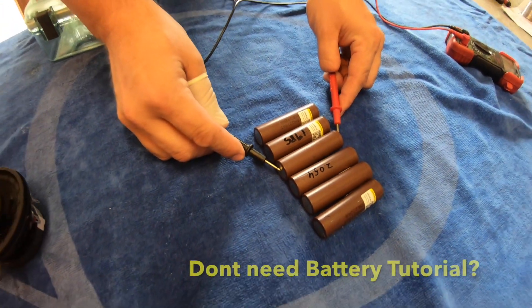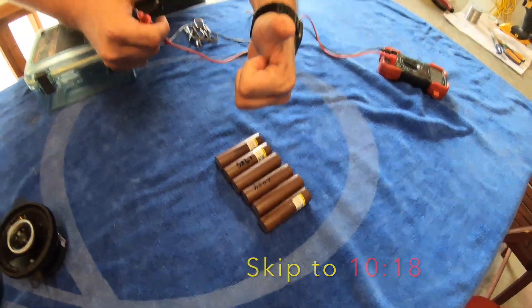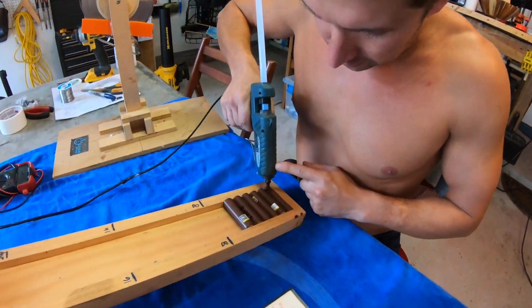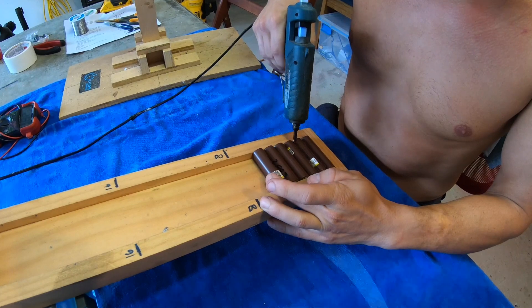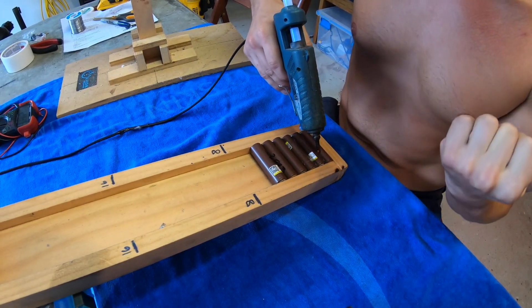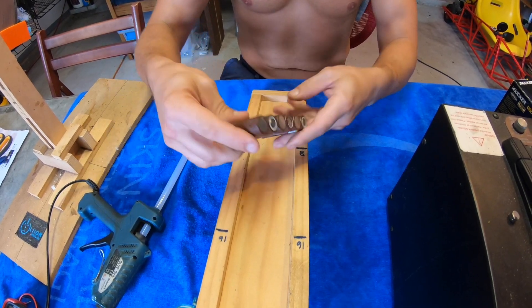Starting on the battery — Joe is making sure all of the 18650s are at the same charge level, so check them with a voltmeter. All good. I've got six 18650s to make 24 volts. They're all staggered: one looking positive this way, the next one negative this way, so we're staggering them for series connection, staggering the terminals.